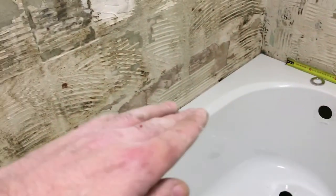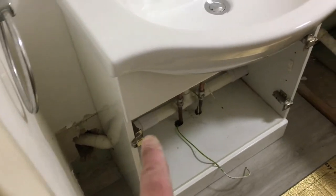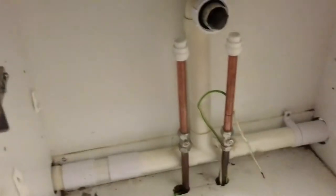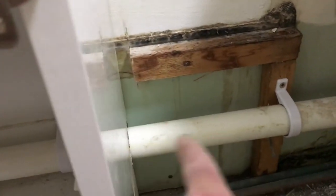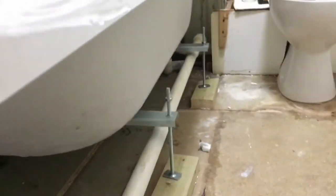Get the bath out, once I get a level, mark the marks, score a line along the wall. Then I can measure the lip of the bath and fit a batten right along the wall and right along here as well. We've got all the waste connected now — one continuous run, comes right through the cabinet, right out the other side, right along and connects down there.